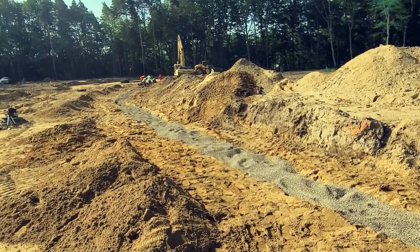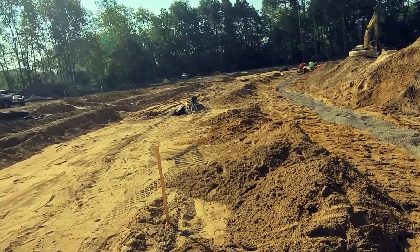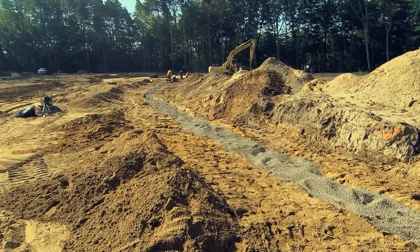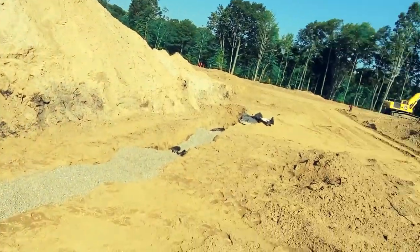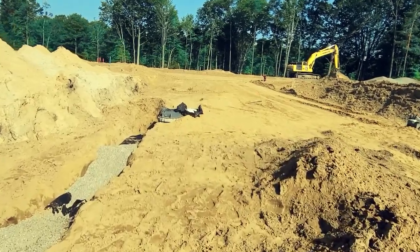This is how it's installed: generally you have an excavator, a dozer with a shoe on it, or a trencher. We're standing essentially in the middle of what will be the road. Down each side of the road you have a run of edge drain, and it's going to take that water and bring it back here and dump it into the manhole.